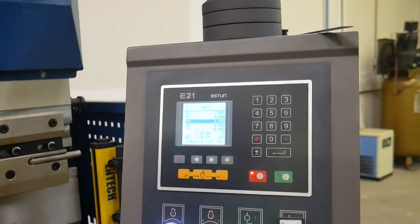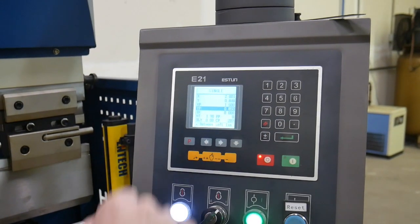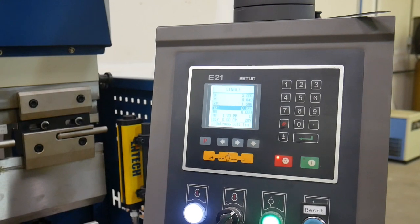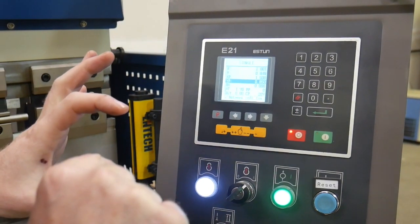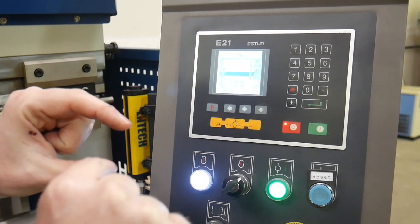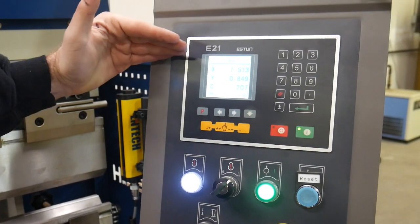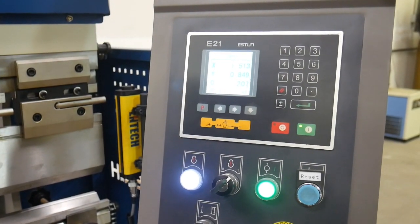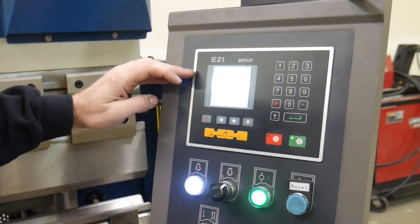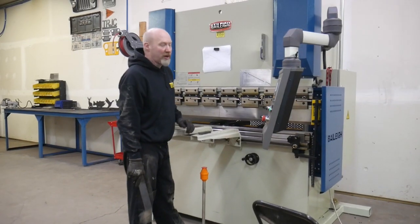The X position is our back gauge position — you type in a number, press enter, and it changes. The Y position is how far down the die goes. The value, say 0.85, doesn't mean it goes down 0.85 inches literally; the bottom die is a square and the center of that die is zero, so 0.85 means we're going 0.85 inches down from that zero. Once you enter a number and press confirm, you can see the machine adjusting the X and Y positions. There's also a fine-tuning dial on the machine for dialing in the back gauges a bit more, and then you use the foot pedal to bend your parts.